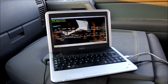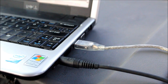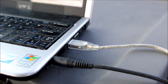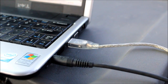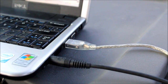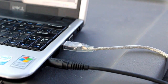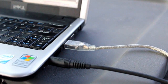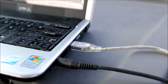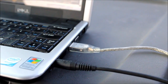Some of the other subdivisions around here have not been decoded and there are no maps. On the side of the netbook you see the two most important external interfaces. The black wire at the bottom is plugged into the microphone jack — it is the broadband audio feed coming from the radio. The USB jack is going to an RS-232 to USB converter, which is used to control the frequency and other settings of my data radio. The black cord is an audio cord which brings broadband audio into the PC.